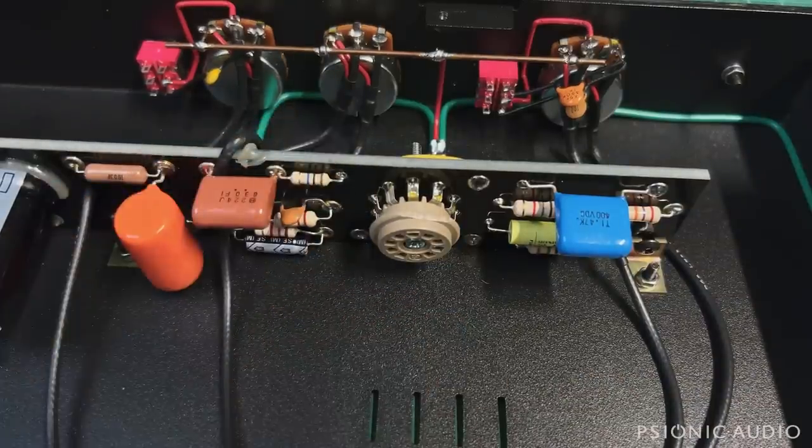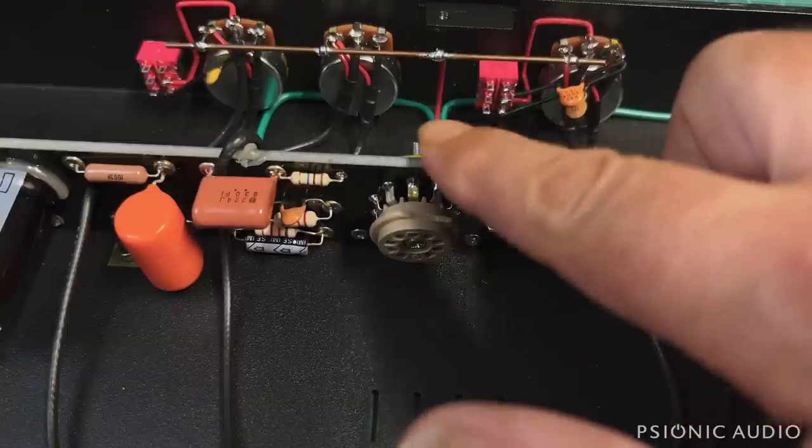But I wanted to point out something cool in here. I got some flak in the previous video on this amp because I don't just fawn over everything that comes in. I mentioned the good, I mentioned the bad. I don't care what brand it is. If the amp is built well, I'll tell you that it's built well. I don't care if it's a Bugera, though that has not and is not likely to ever happen. But I mentioned that this Ceriatone was a mixture of the very, very good and a few things that raise eyebrows. Like the IEC connectors are this really amazingly brittle plastic, and I found that they have broken on quite a few that have come in. That's not slamming the company. That's saying, hey, whoever they're sourcing their IECs from, that's not a great part, but the parts are used well. I will point out the things that raise my eyebrows, and I will point out the things that are really, really good. Here is a thing that is really, really good.